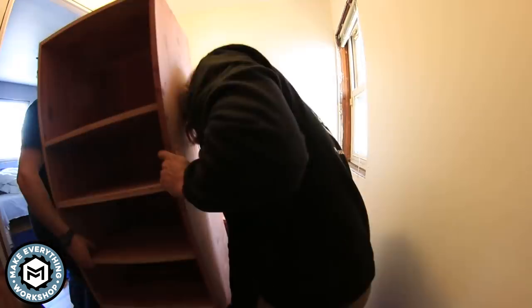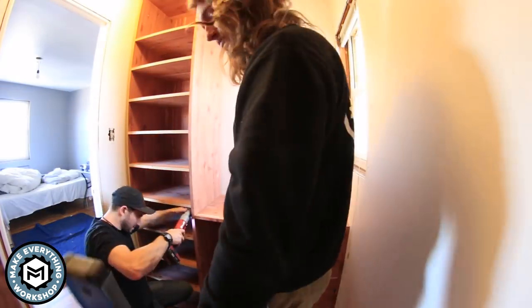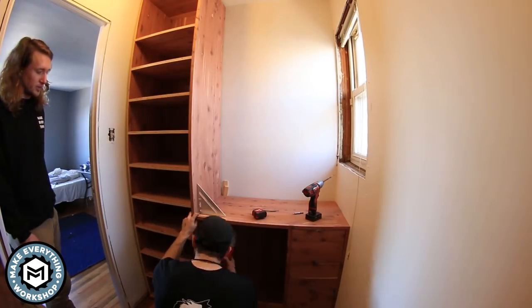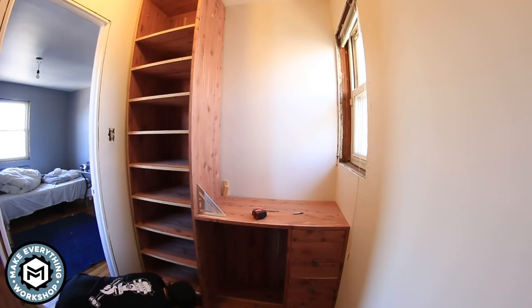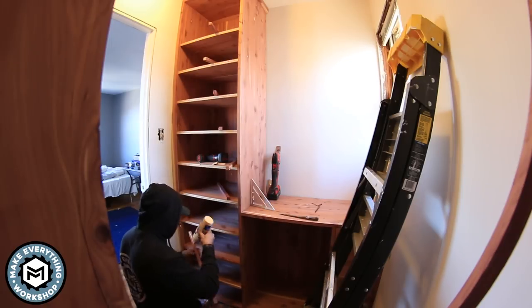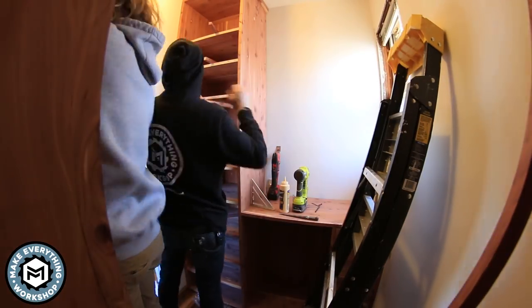Probably the most challenging piece to fit was that tall cabinet - it just fit by about a quarter of an inch. There are pocket screws installed just to make sure everything's nice and tight. We didn't put any nosings on the tall cabinet yet because I wanted to first add the face frame on the left side, scribe it to the wall, then add the nosing. All in all this was a pretty straightforward installation - we didn't have any major problems. There was definitely some intricate scribe work and we had to fight with the cabinets a little bit, but in terms of things that can go wrong on an installation the list is very long, and we were very fortunate.